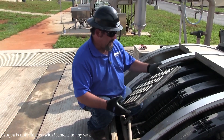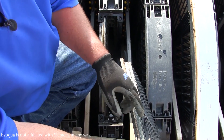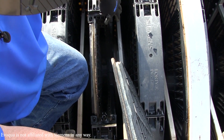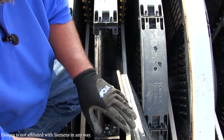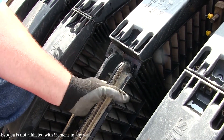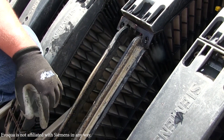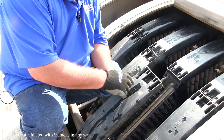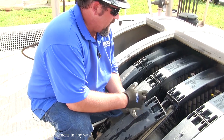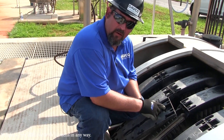When you replace the panel, you've got to line it up with these grooves right here. Our panels have a pressure-assisted seal, which means this is an L-shaped gasket that goes around the panel. When we put it in, it slides into this groove right here. We want to make sure when we reinstall the panel that it's lined up correctly. Once the panel's in, give it a slight push to seat it at the bottom. Once everything's seated, we can reinstall the caps. One thing to note on the caps — they're marked with a rotation arrow, which is a good indicator for operators that the filter is actually rotating in the right direction. Make sure to put the caps back with the rotation arrow in the correct orientation.